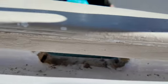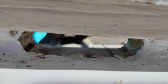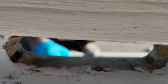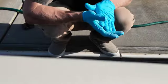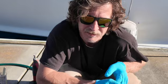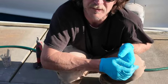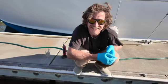Trying to show you a little before, and just all this little rotty space here. Looks like they tried to clean them out, but it's a tough place to put actual mat in there. They tried their best, it looks like, and it just is kind of rotting away. So I'm just gonna do the filler, a little fairing compound in there, and hopefully that'll fill it up and seal it. Should be fine. There you go. I had zoomed in.